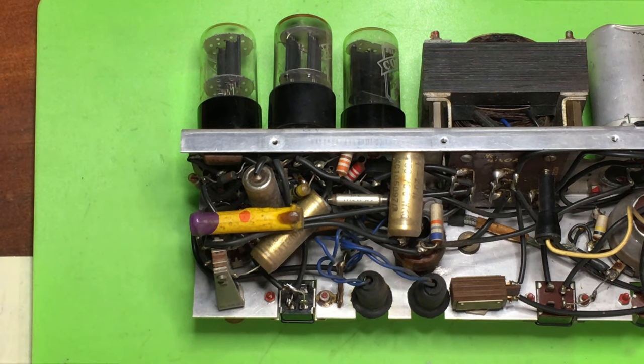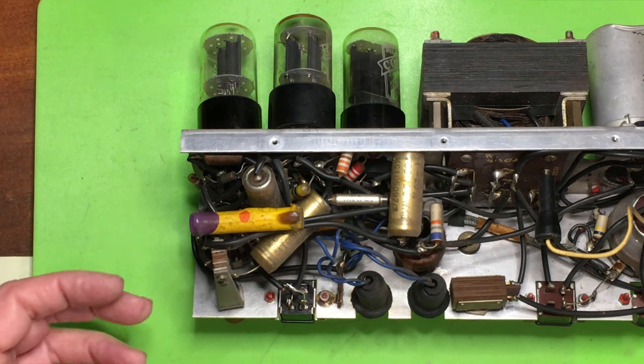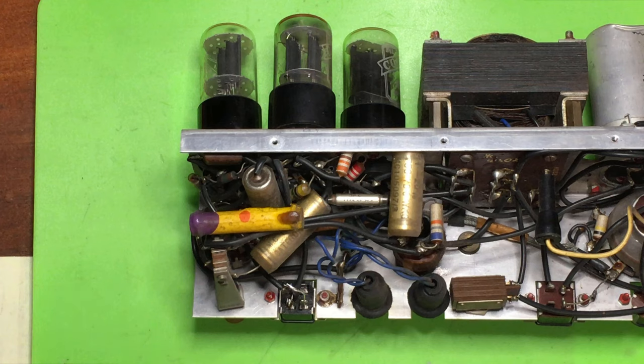Headphones, I've not found anything ideal yet. Because, as I say, the headphones run through a 1 meg volume pot. They come directly from the wire of the pot, which means they need to be very high impedance to get any real audio efficiency and audio level.